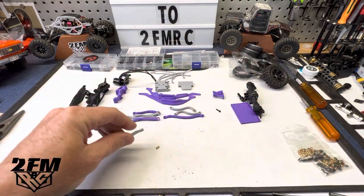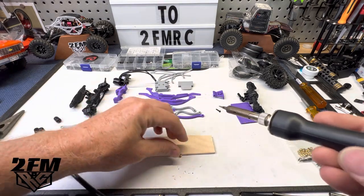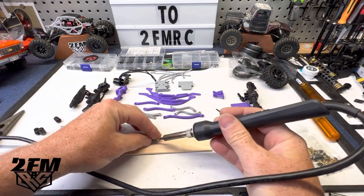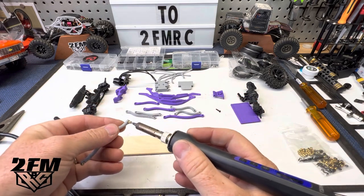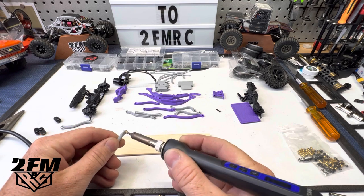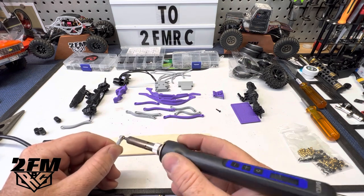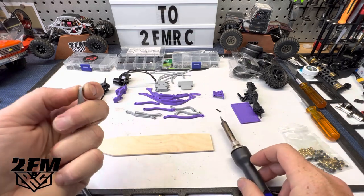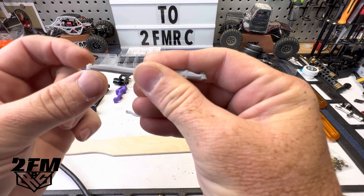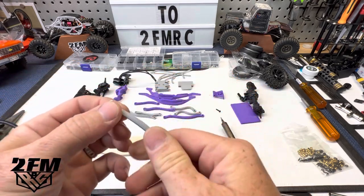For inserting it into the link, you can see it doesn't just fit straight in there. For that, I've been using my soldering iron. I just turn it on, put the ball stud on the iron, and as that thing heats up you can push it in. Then just keep moving it as it cools. And you can see — that's in there and it moves nice and freely. Works really well.